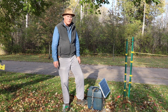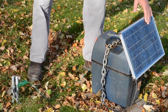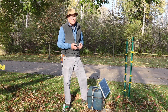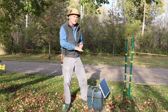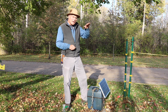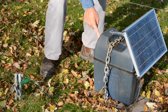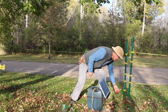That keeps these things from walking away — they are pretty expensive. The fencing unit itself has a solar charger on the top, and mounted inside the box is a marine grade battery, also called an RV battery. They're deep cycle batteries, able to take a significant discharge and still be charged back up again. Car batteries will only take shallow losses before they're no good anymore, so it's worth spending a little bit extra for that marine grade battery. There's a positive connection that runs over to the fence itself.